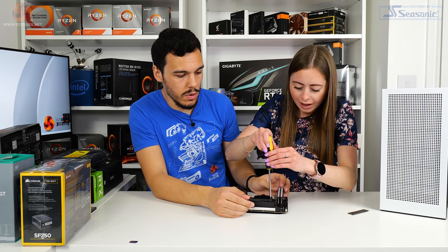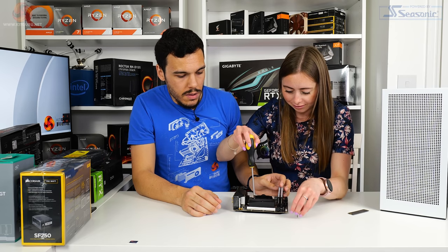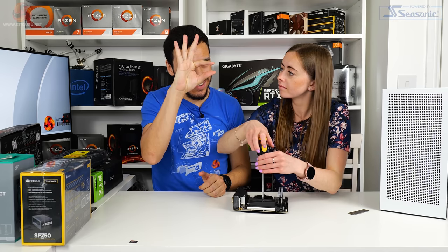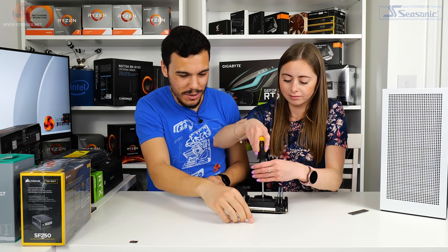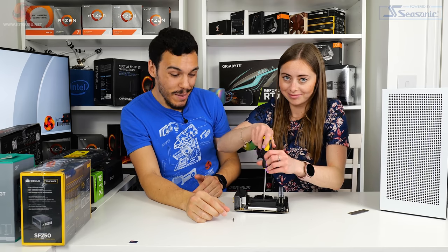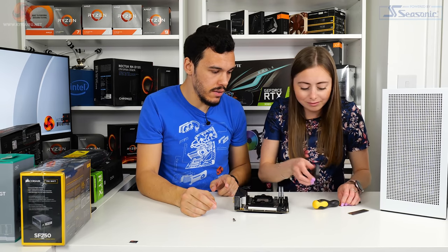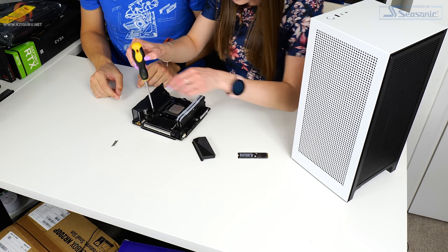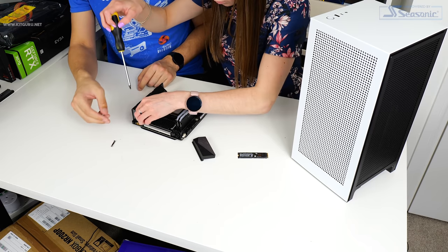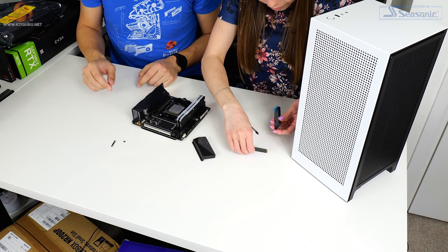Gigabyte applies a nice big slab of metal as a heat sink on the SSD slot on the motherboard — this is a really good feature. You need to peel the plastic protection off — it's sticky because it's a thermal pad. I think we actually need to pull the secondary mount off first and consult the manual. The manual says: loosen the screw from the heat sink, remove the PCH heat sink, locate the proper mounting hole, tighten the standoff first. So we remove the standoff, install the SSD, and now it fits into position perfectly. Then screw the standoff back in and reattach the heat sink cover — it has a sticky thermal pad to transfer heat very nicely.